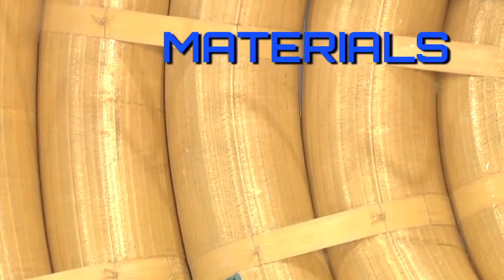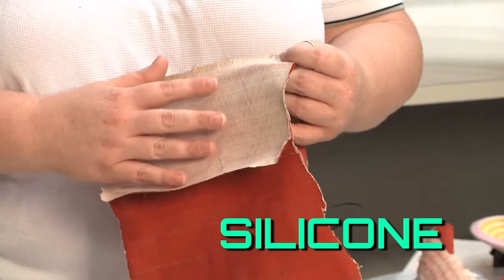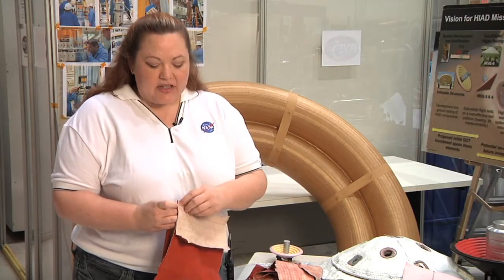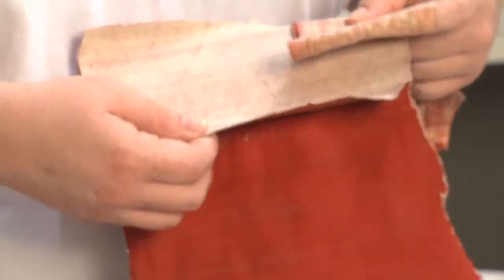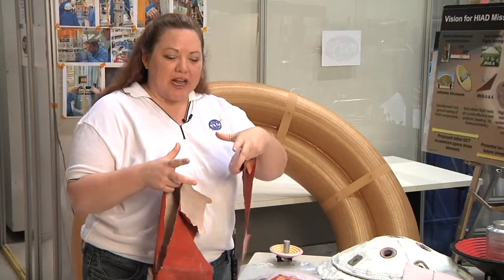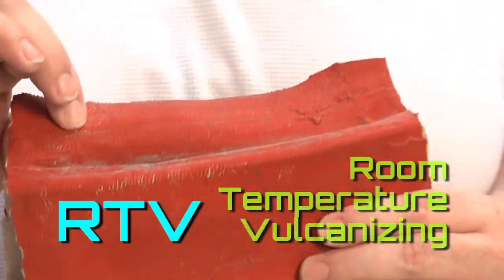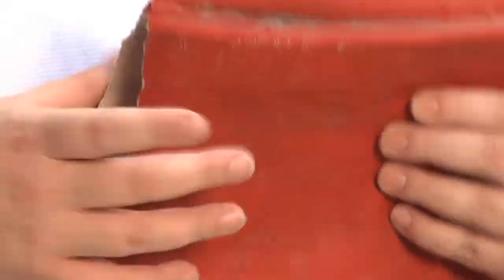First, let's take a look at the materials they're made of. Inflatables are built using several layers of materials, and each layer has its own purpose. The base part, the inside — the main structure — is a silicone liner. Just like a balloon, it's a rubber-type material. It's the point of keeping the nitrogen inside the vehicle. On the outside of that is actually a Kevlar — the same stuff that police wear in their bulletproof vests. You can see that a little bit better here; it's the yellow that's here. It is a woven material. We keep it interlocked; it gives it structure and keeps it within a certain diameter so it doesn't over-inflate. And then on the outside of that, we have an RTV — a rubberized coating, just like the caulk around your bathtub, but for high temperatures.